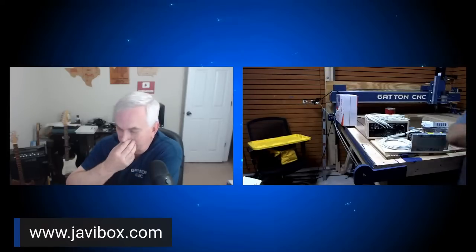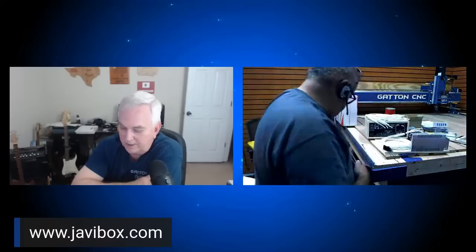I bought the Avid CNC, the Pro 4848 CNC. They break it down where the base kit is all the mechanical stuff, not counting the legs. There's a leg kit. I bought that. I bought their plug and play NEMA 34 CNC controller system. So it's got the NEMA 34s. I think they're like 960 ounce or something like that. And of course, it's rack and pinion.